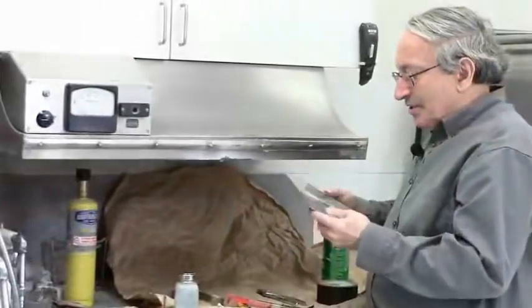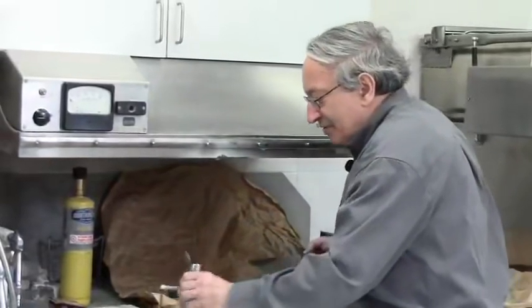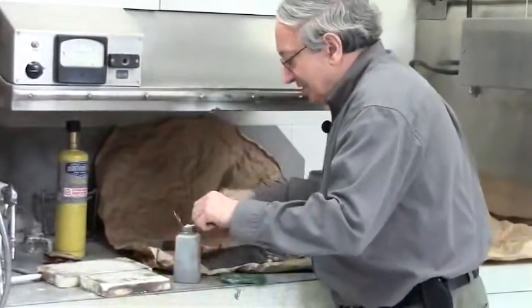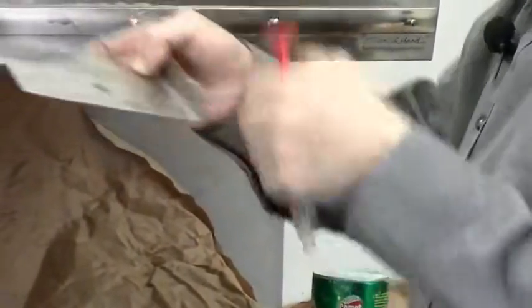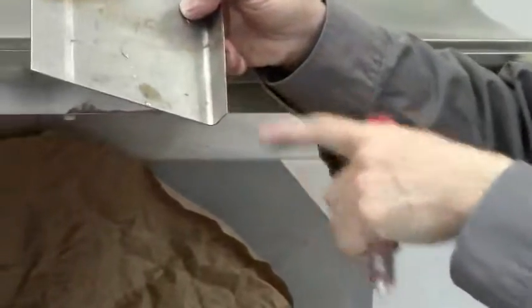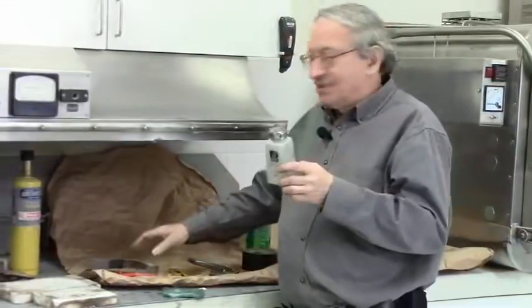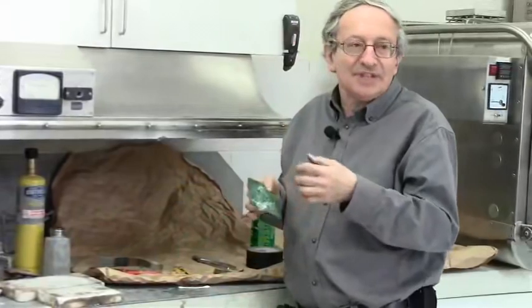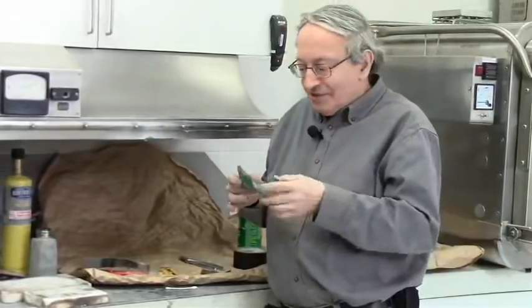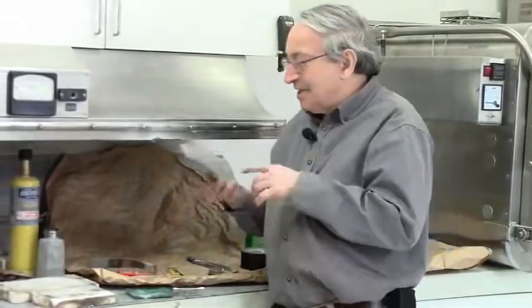Now as a comparison, if I do the standard textbook solution and I take a solvent, okay, so say if I take acetone and I clean it with acetone and I do the wetting test, let it dry. The wetting test, it does nothing. There's no wetting. Okay? So the difference is that this just dilutes the hydrocarbons but still leaves a monolayer, while the Ajax or the Comet or these things decompose them at the end, just like soap does, and emulsifies or decomposes them, oxidizes the residue or whatever chemistry takes place, and leaves a surface with high surface energy.